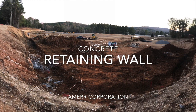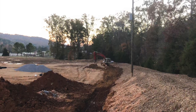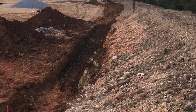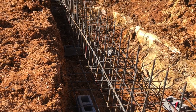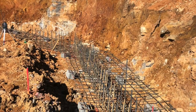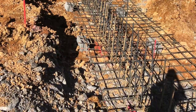Thanks for watching this concrete retaining wall video. This is a retaining wall we completed for a local school system — they wanted to build a baseball field here. As you can see, we used quite a bit of rebar in the footing. The footing was about 36 inches deep because we're going to have an eight-foot wall.